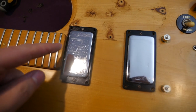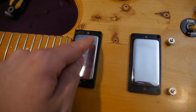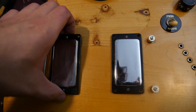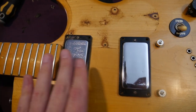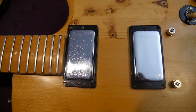The reason that happened is the pickup got spun around too many times. Since these don't have pole pieces indicating one direction or the other, it's hard to know which way is the top or bottom originally, and that made the wire too short, and then it snapped again. But it looks like both of those have been repaired previously anyway, so it's probably a good thing that was touched up.